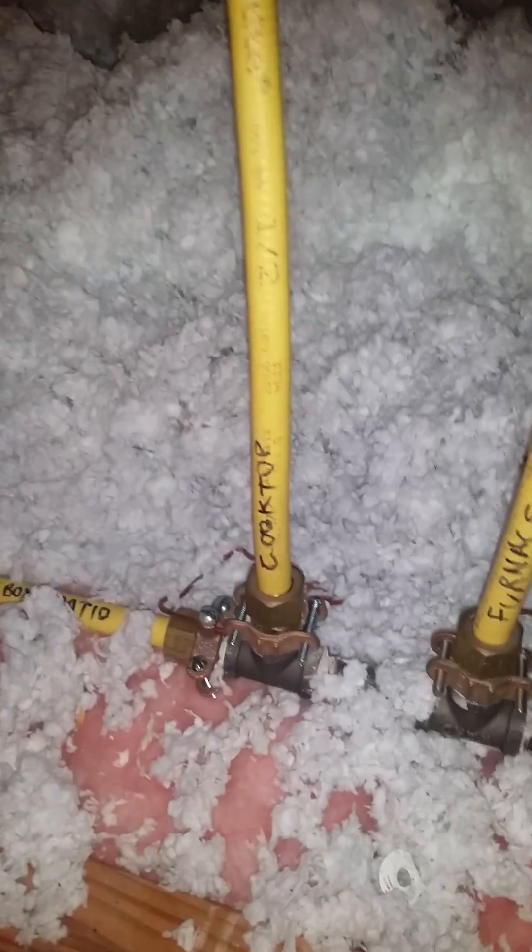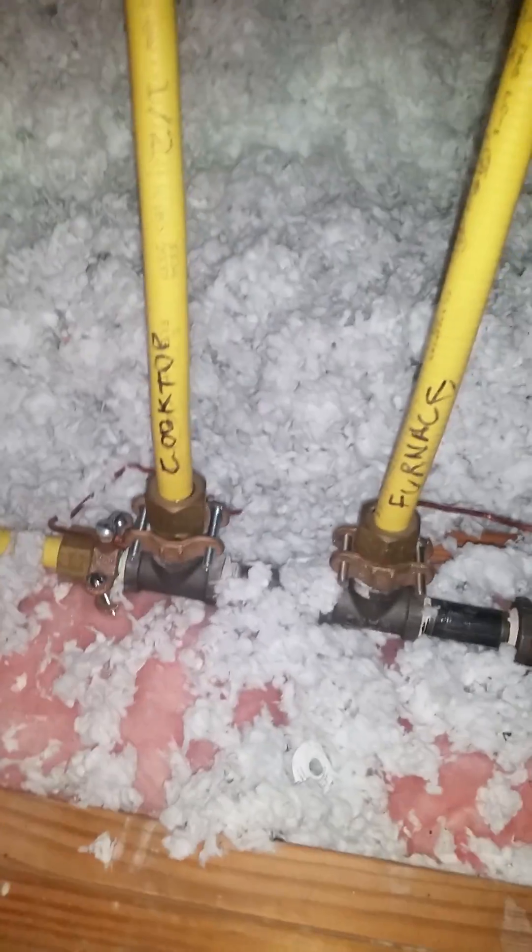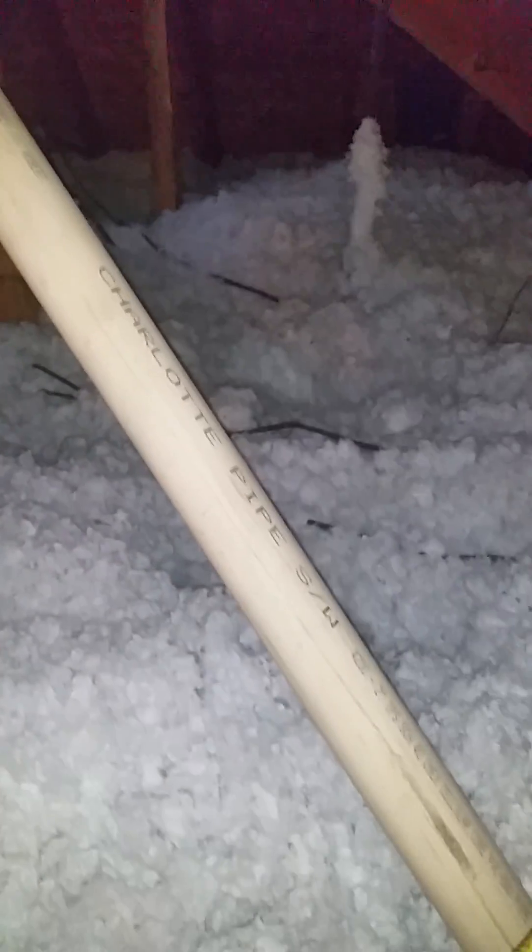This ensures that each and every individual appliance that is being gas-fired is bonded. It's hard to see, but they're running feeder wires in here, sort of daisy-chained through the system and through these lugs, so that it all leads back to the main wire which is then running to the electrical system down below us here.